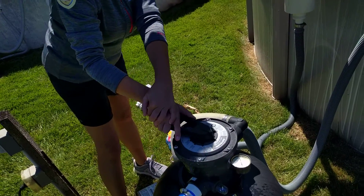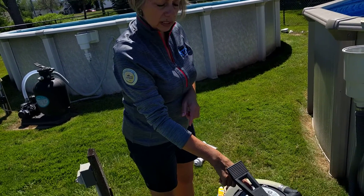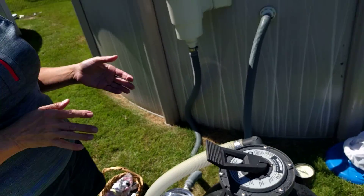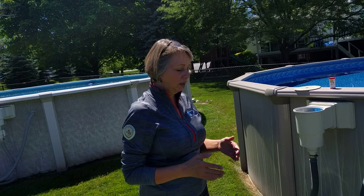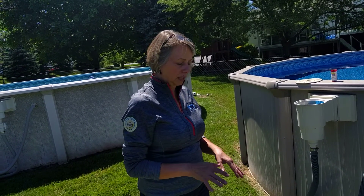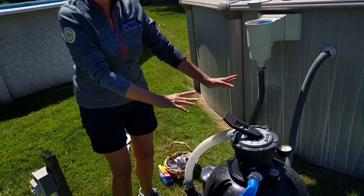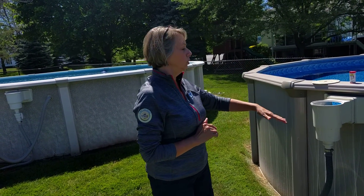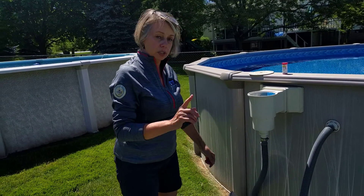Pushing down, clockwise direction, back to filtration and we're good to go. Let's talk about the other settings on here. The waste setting is super good to use at the beginning of the season. Let's say you've just opened up your pool and you've got a ton of leaves at the bottom — you don't want to introduce a lot of that into the sand, or if you have a really good algae bloom going and you're going to be vacuuming, you don't want to introduce live algae into the sand. Once you have an algae bloom in the sand, there's nothing you can do other than changing the sand. Vacuuming to waste, or just wasting water out of the pool, is going to pull water directly out — it bypasses your filter and shoots straight out through that backwash hose. You can only vacuum to waste until you lose prime — until it gets to the bottom of the skimmer opening. Add some more fresh water, do it all over again. It's a really handy thing to have.